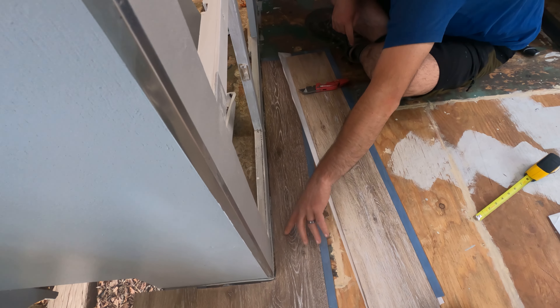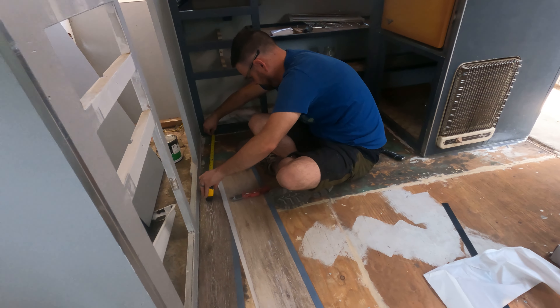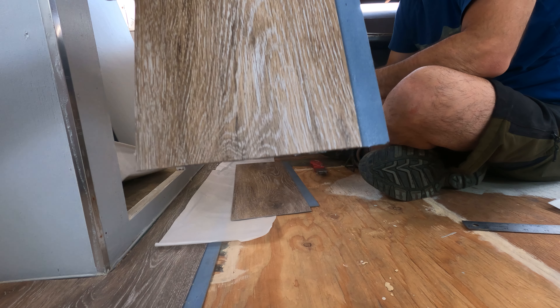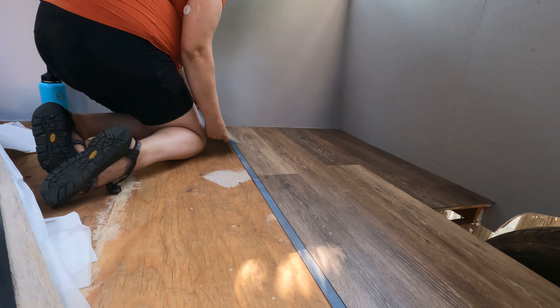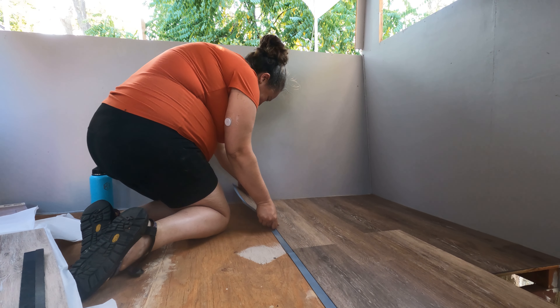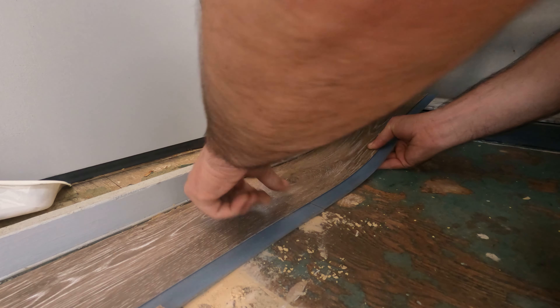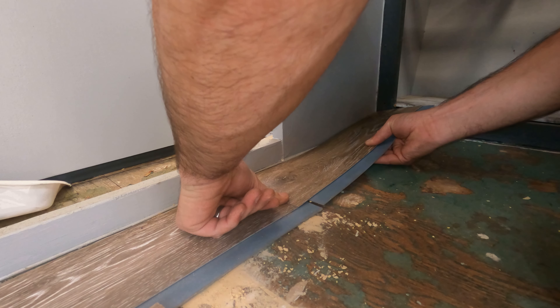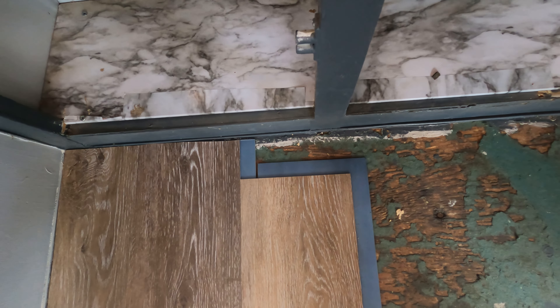But before we can lay the floors, I've got to scrape some paint off because there are some globs of paint on the floor that won't make it smooth — because I'm a messy painter. There are also gaps in the floor that have to be filled; we're going to fill them with some plastic wood. These two pieces of wood here are not attached together on either side, except for here and way over there at a metal I-beam. Between there and there is nothing, so I need to manufacture something to hold those two pieces of wood, two pieces of flooring, together.